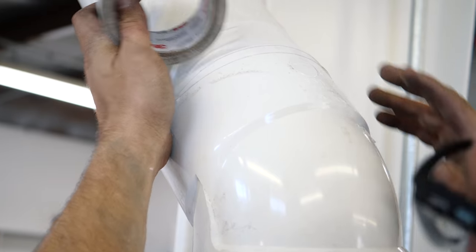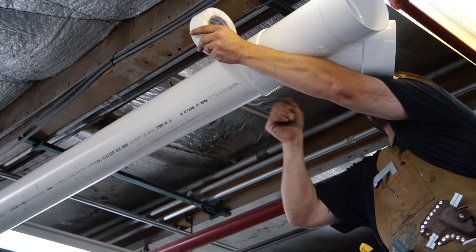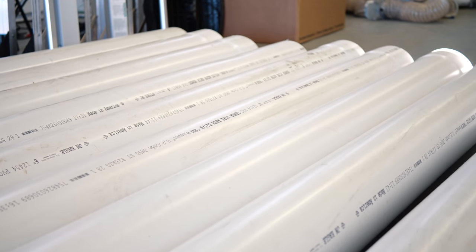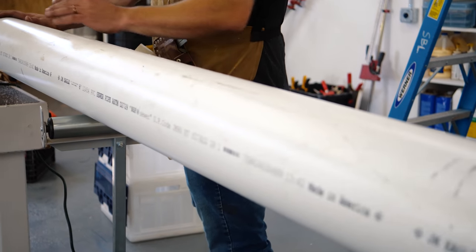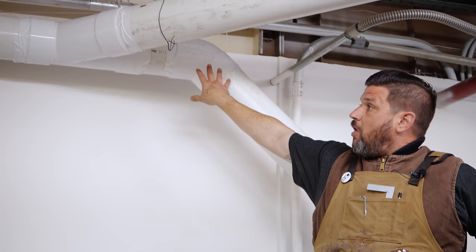We are really lucky in this building — the previous tenants ran a one-inch thick airline tubing, so we had lots of places to put tie wire, which really sped things up. You'll see that I taped every single connection. One thing I learned from my previous dust collection system is that permanently bonding pipes together means you'll never be able to use them elsewhere. So everything here is taped — not the prettiest, but we used very high quality 3M duct tape. We used six-inch thin-wall PVC, which has an outside diameter of 6.25 inches and is the cheapest option I found.